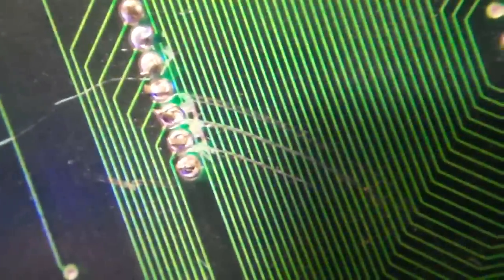Right here is the sound chip. I'm going to flip this thing over to get a good light on it. Do you see that right there? There's damage to the bottom of the board — a scratch — and you can see to the right of those pins, those traces are actually tripped or cut right off, and those go right back to the sound board. There's a tear, and the sound chip is right here. So I'm thinking one of the traces from the sound chip is actually busted. I'm going to repair those traces using some very fine wires to fix that and do some continuity traces on it.